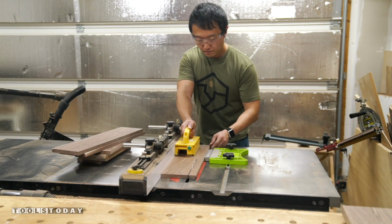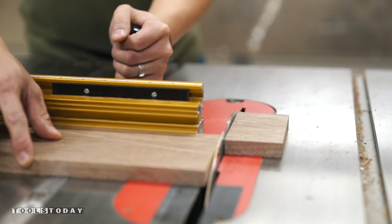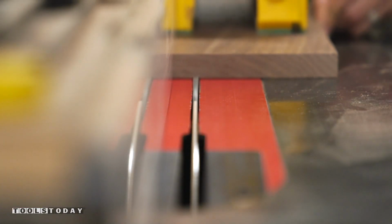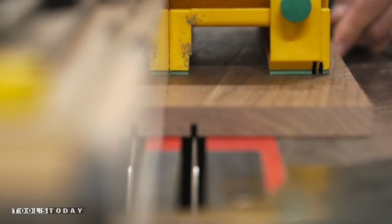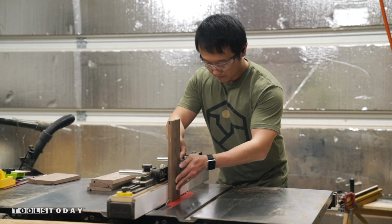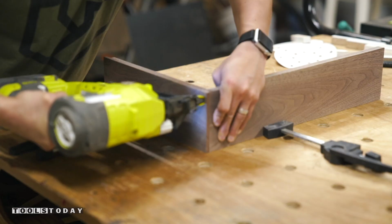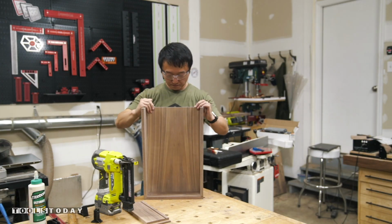With the case structure complete, the next day I moved on to making the drawer boxes, which have sides that are 5/8 thick with dados cut into them to accept the 1/4-inch bottom panel later. And the side panels of the drawer boxes will all receive rabbets, which is how they attach to the front and back panels, using glue and some brad nails, as you see here.